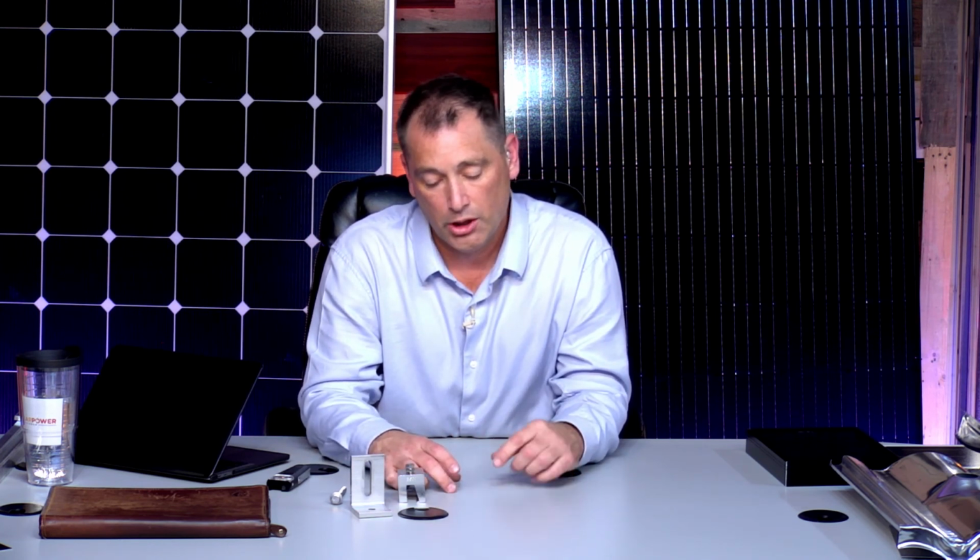You can screw those in with some adhesive behind them and then cut out and then have your conduit go down through that, and it fits very tight and snug and it keeps it from leaking. You see that on a lot of applications in roofing. So any pipes that come through a roof, they use those boots. But we use them for the 3/4 or 1/2 inch piping, whichever we're going to put in the roof.